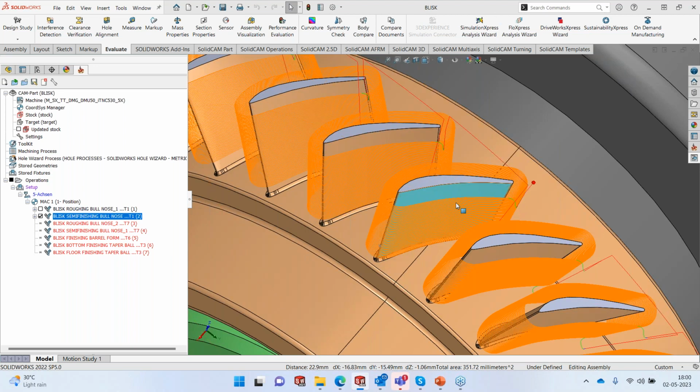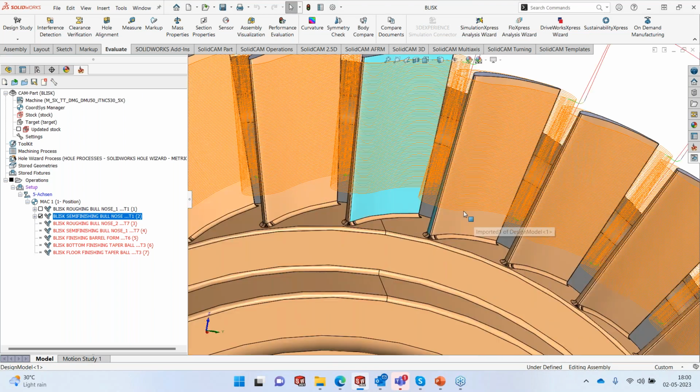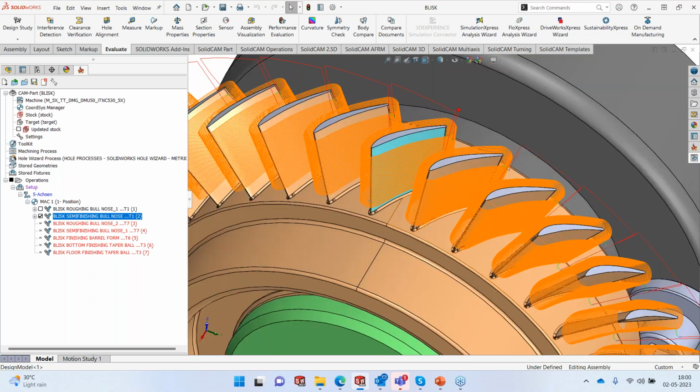So that's the calculation. Again, you can see here it's not gone completely down, it just stopped here, because this is it. Beyond this, the holder comes into play. So this would leave about 0.3 to 0.4 millimeter of material for my final finishing